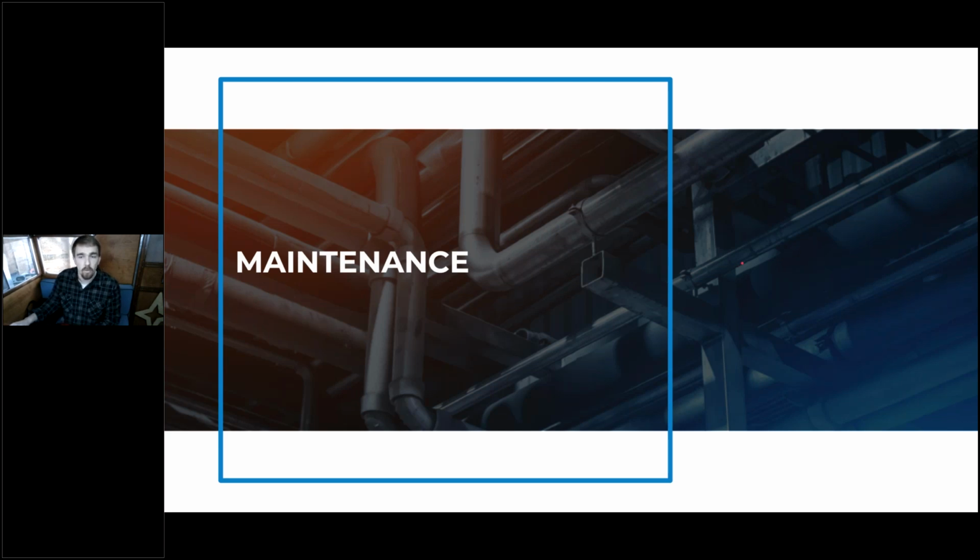Owners need to think about what the overall maintenance costs will be when they're considering buying a heat pump water heating system. And designers should think about things like clearances and maintenance requirements in the long term, as well as installers that are going to be pretty much passing the torch to the building manager in a lot of cases. They need to make it known to that building manager that the maintenance portion is really, really important. And so usually a service contract should be set up, or the maintenance team for the building should be really well tuned into how to keep this system properly maintained.